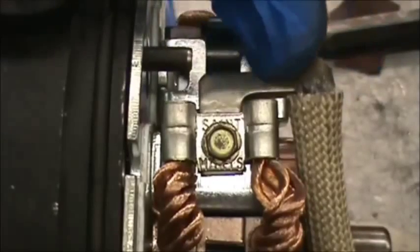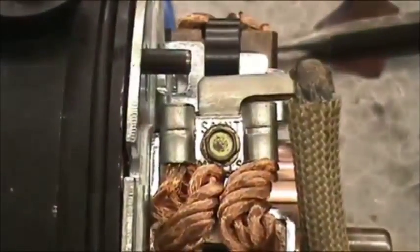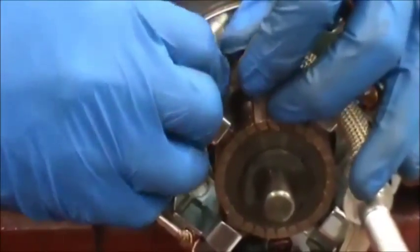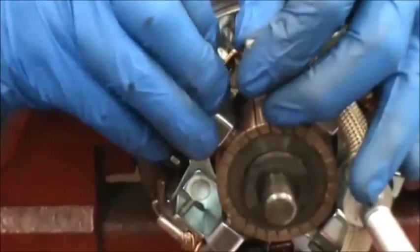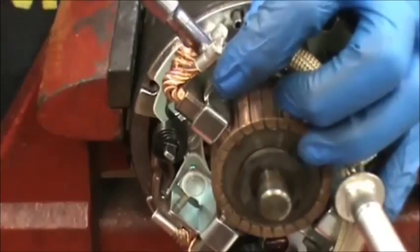You can see how this is the ground lead coming out — it's at a 90 degree angle to the brush lead. Then take the copper leads coming off the brush and mash them down. We flipped it over — same way with the last brush. Lay the ground lead on there first, then the brush lead. Get everything tightened up.